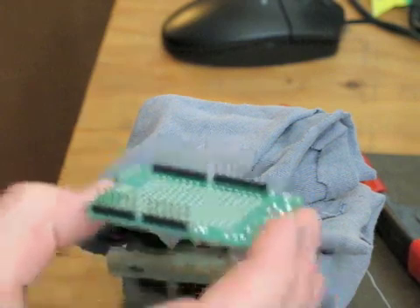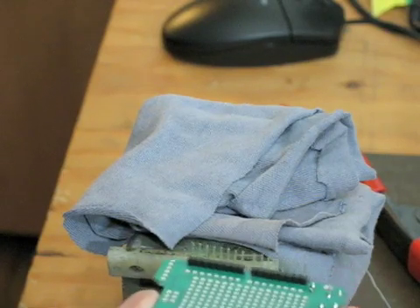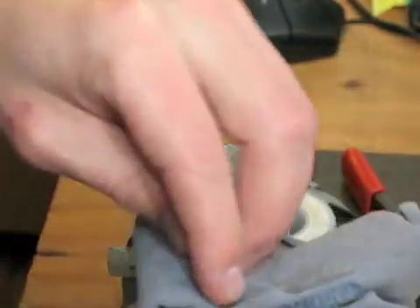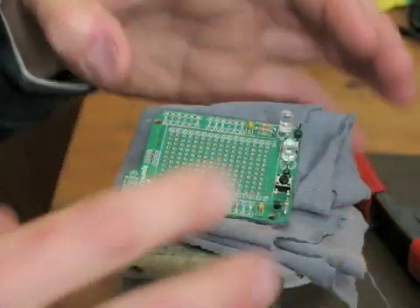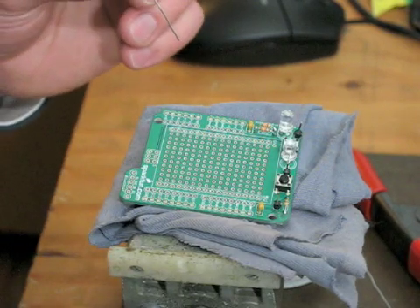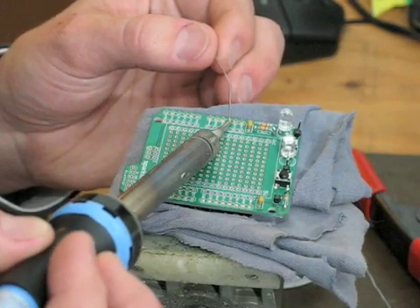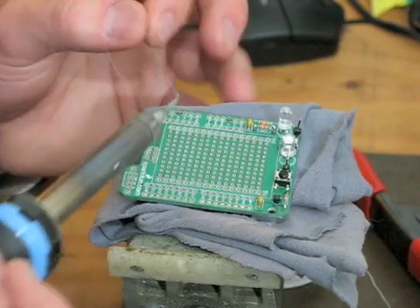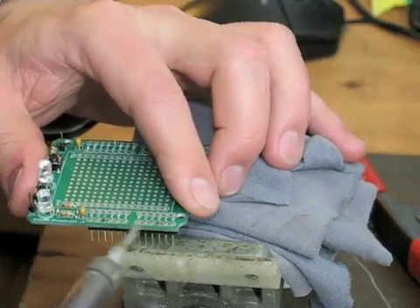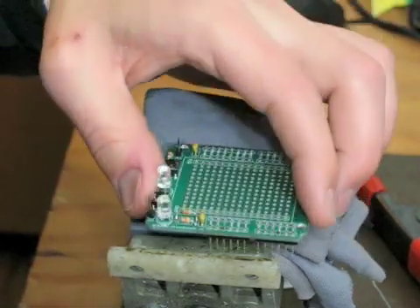This step in the Arduino Protoshield project will solder the two 8-pin and the two 6-pin headers. An easy way to keep these from falling out when you flip it over to solder is to use something like part of a t-shirt or a piece of foam — lay that on top, flip it over, and lay it down on a flat surface. Gravity holds everything in. We won't solder all the pins at once — we'll do one pin on each. Solder a middle pin on each header, then check alignment.